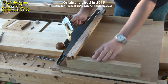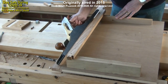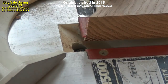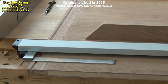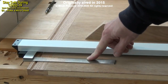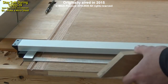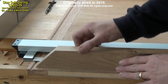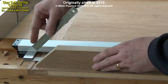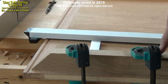It sits on a stout fence at the front of the board and a support fence at the rear. I've set a trisquare off the edge of the jig so it's at right angles to the V groove that we've just routed out. Now I can place my main fence against that trisquare blade and move it up so it's flush with the V groove. Now we can drill through for some fixings.